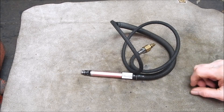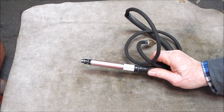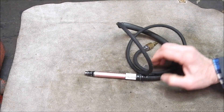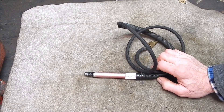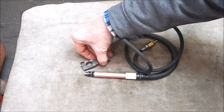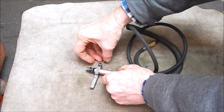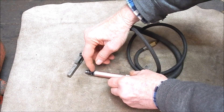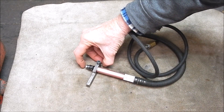Now there are several sorts of cutting discs - we'll have a look at them. For small lathes like mini lathes and micro lathes, I suggest something like this: an air-driven pencil die grinder that can take a whole range of Dremel-sized accessories, including very small cutting discs. You can easily make up a mount for one of these to fit in your tool post. Here's the one I made up many years ago - it just fits on like that. You clamp it in the solid area near the nose. With a small cutting disc and some compressed air, you can cut anything you want.